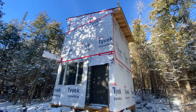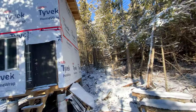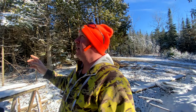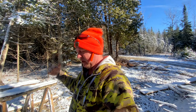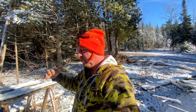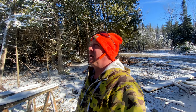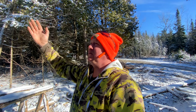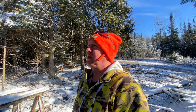into that wall. So that double top plate on the corner here and here, I put metal strapping because I didn't overlap the top plates with the bottom one, with the one wall underneath and the top wall over top, so it locks them together. I didn't do that. I couldn't do that, or I don't remember, but anyway. So I put a metal piece of flat strong tie and some 10D nails, and I tied the front wall into the side walls so that it can't go out or in.